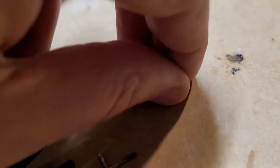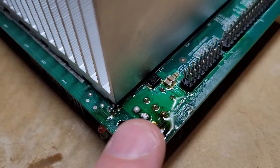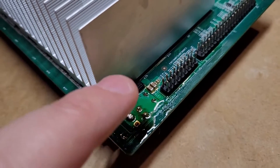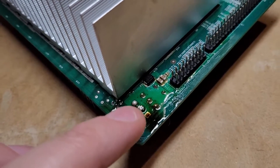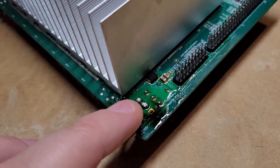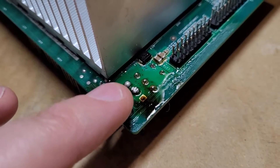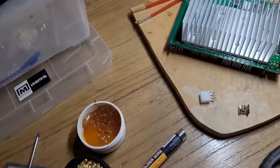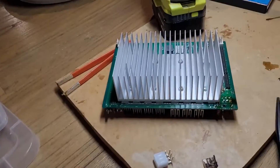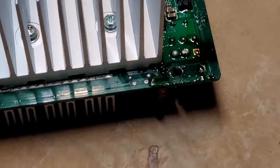I also tried a technique I saw on YouTube: there's a little piece of copper wire in there that I shaped into a little oval and put around the connectors, then dropped solder in to create a little well of solder — getting it really onto those old factory solder joints. That seemed to get good adhesion. I put the iron on top and hold it for about 30 seconds, then boom it just comes out. Let's try and do this with you now — I'll zoom in.